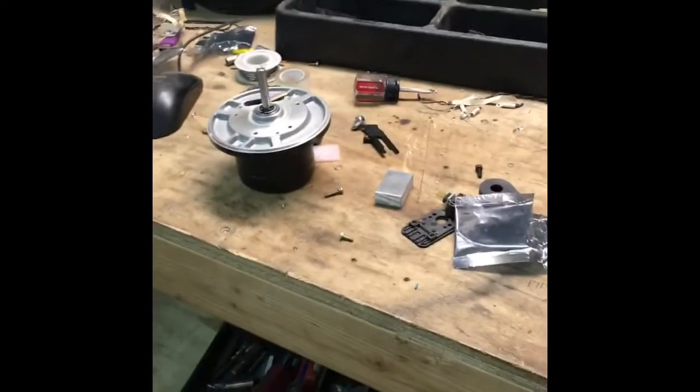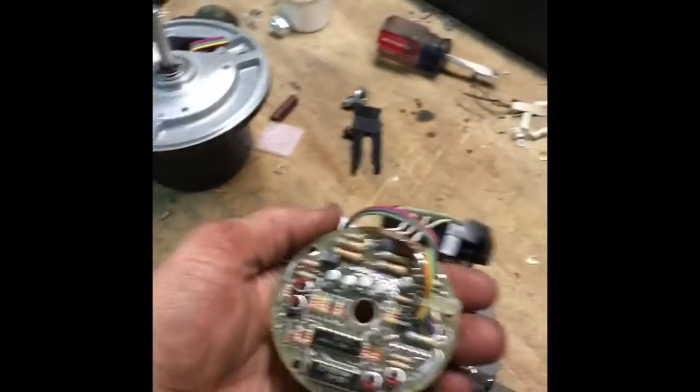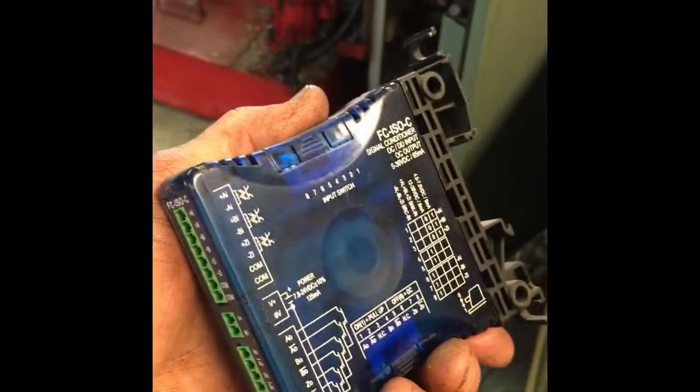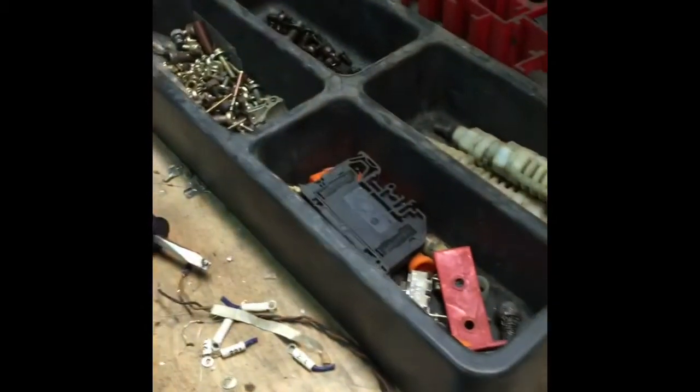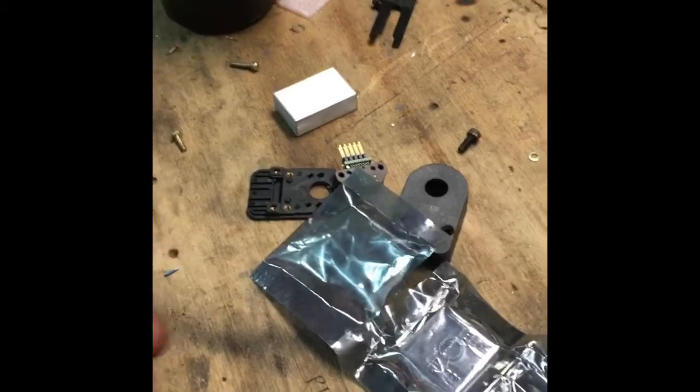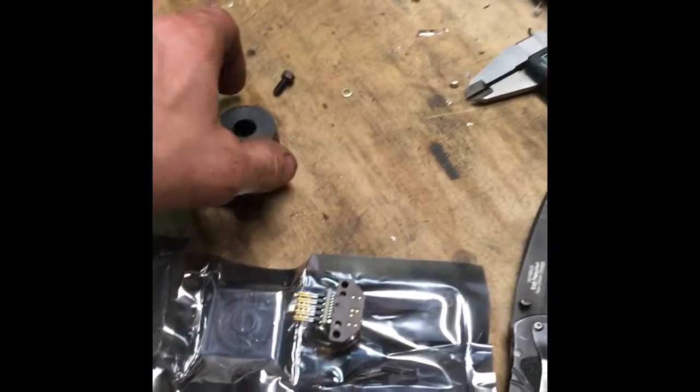Hey, what's up YouTube. I just wanted to make a quick video talking about how I am fixing my encoders. The machine came with these non-differential optical encoders giving out a 12-volt signal, so I had to feed the signal through a 12-volt to 5-volt optocoupler because my controller only takes 5-volt impulses. That didn't work out because I kept losing steps and the machine would lose itself over time. So I bought some 5-volt encoders from US Digital.